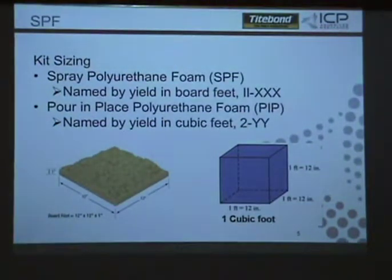No, it can't. The dip tube's in there, so it's sucking off the bottom. Now, if you lay it flat, then you're not going to get chemical out. But best practice is to invert the cylinders and then empty them, and then open them in that air box. There'll still be a little bit in the dip tube, but that'll go away pretty quick.